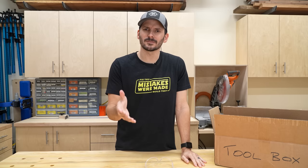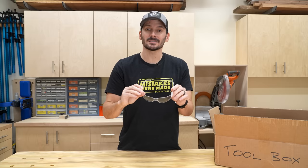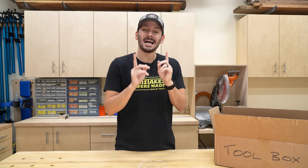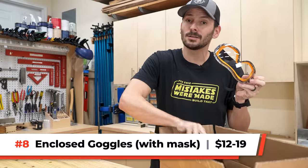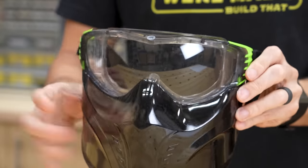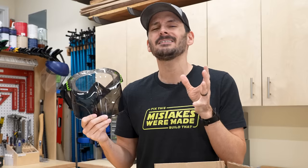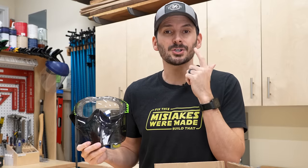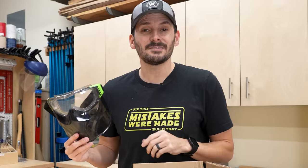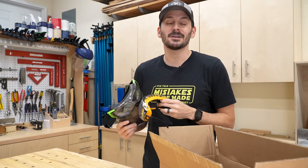Staying with safety — I think we've all learned from Norm that there is no more important safety rule than wearing safety glasses. I like these clear thin versions — just make sure you have a pair that's ANSI rated and will stop impacts. But if you're really generating a lot of dust, especially working with metal or overhead, I'd recommend enclosed goggles or enclosed goggles with a mask. The mask comes in at $19, or just the enclosed goggles which I got for $12. I really like the extra mask because it has the whole Vader vibe, and also it helps protect against anything coming off your cheek — especially when grinding, sparks can bounce off your cheek and get under normal safety glasses. Wear these whenever you're cutting metal, grinding, or working overhead.